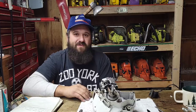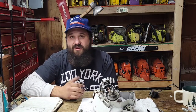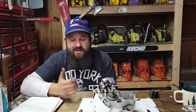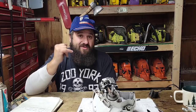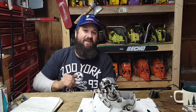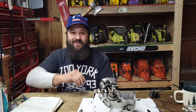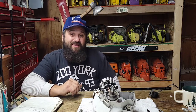If you're cutting small wood all the time, a 50cc saw is what you need. I'm often cutting 18 to 24-inch poplar — if I'm going to pull a longer bar, I want to pull it with authority. Anyhow friends, that's the Echo. When I figure it out I will let you guys know. I think it's a small bore long stroke issue. I've talked to a few other guys and we've put our heads together. I think I'm going to retime the saw and do some work to the upper transfers and see if I can get the saw to clean up. Thanks for watching, take it easy — I'll let you guys know when the Echo is fixed. We'll figure it out, friends.